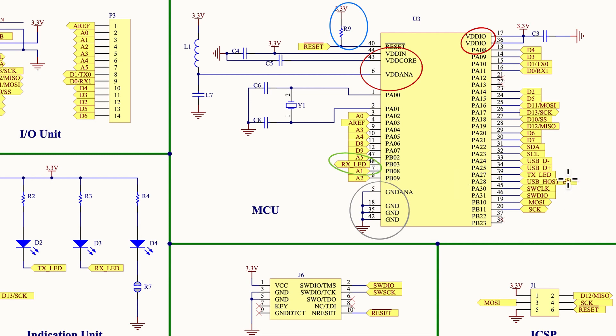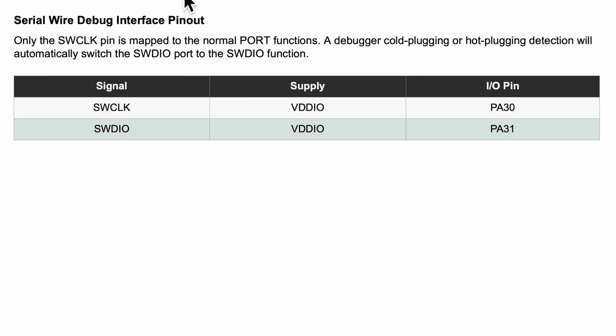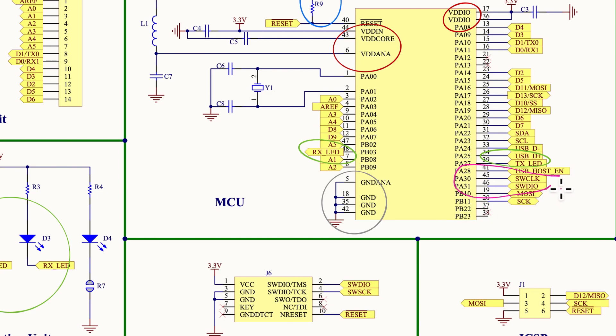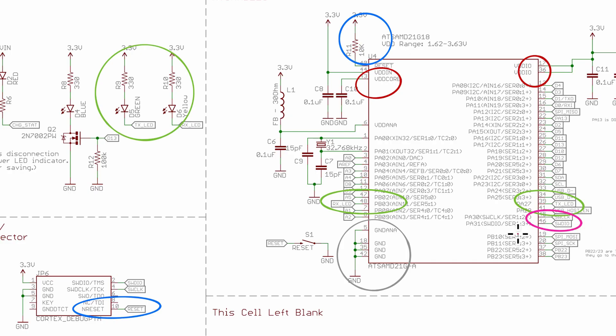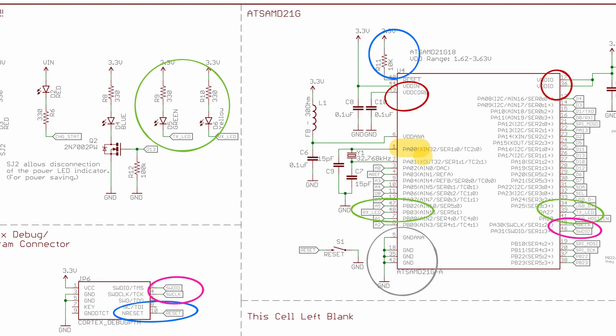Next are the LEDs. Although they are optional for actually uploading the Arduino bootloader, having LEDs connected to the TX and RX pins can be useful for debugging or notifications. For the SWD pins, in the datasheet these are PA30 and PA31. The SWD connector can be just 5 through-hole pins or part of a standard 10-pin connector. Finally, a note on the crystal: both reference schematics include one, but I chose to eliminate it as it was not required for my purpose.